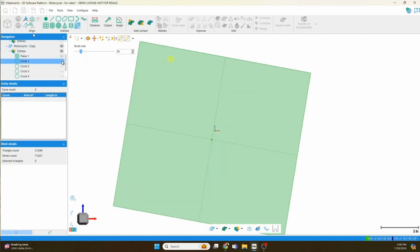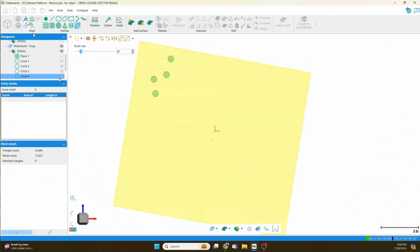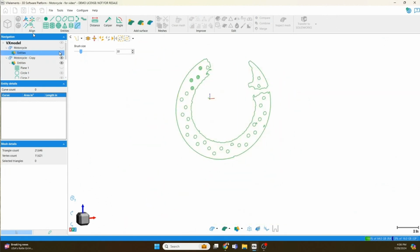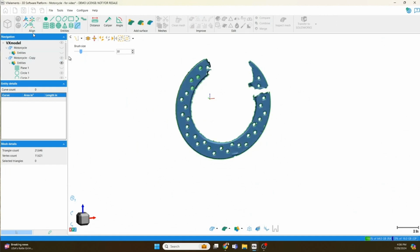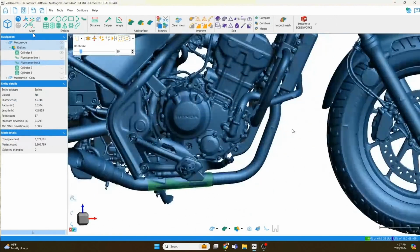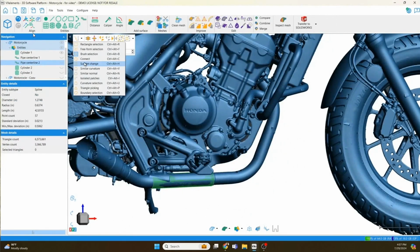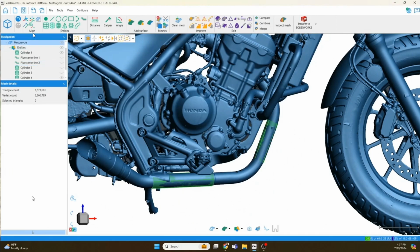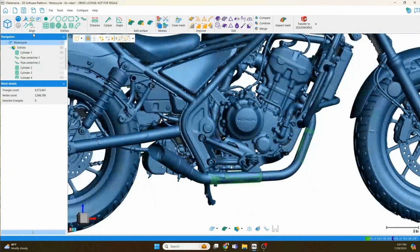The other thing you can do is a silhouette range, which I kind of talked past earlier. We basically took a 3D cross section of the entire profile, projected into the plane. So instead of getting full circles, we're getting a profile that we can send to our modeling software to sketch on, essentially making it a 3D sketch. Here we're going to add, if I want to get some angles of pipe, that's fairly common, doing pipe bending.